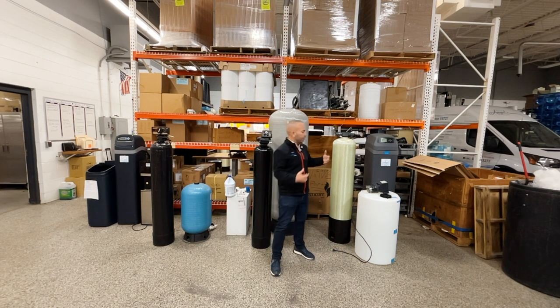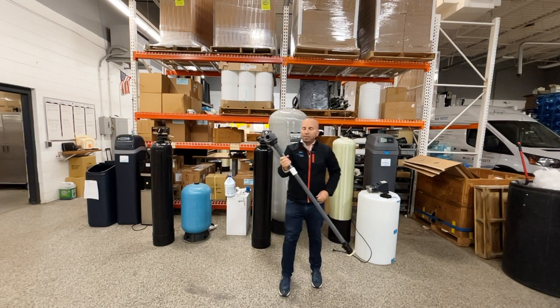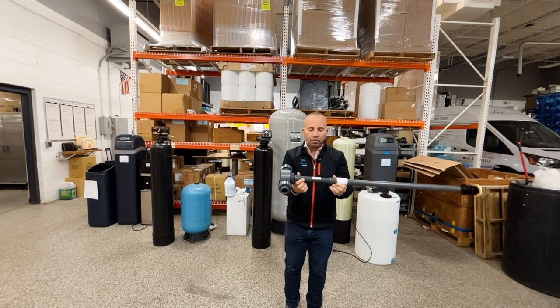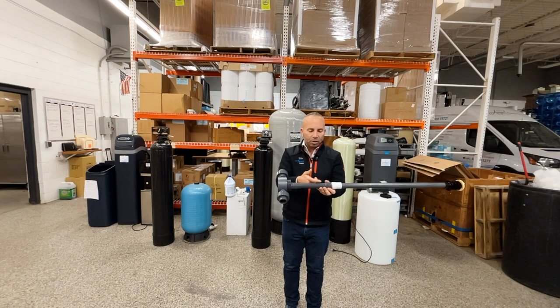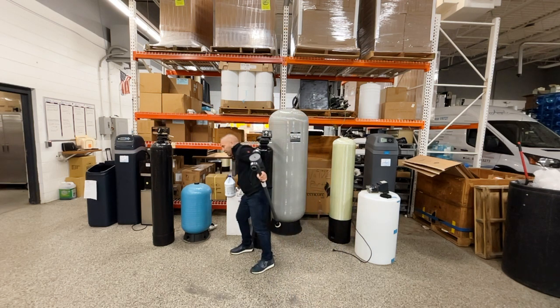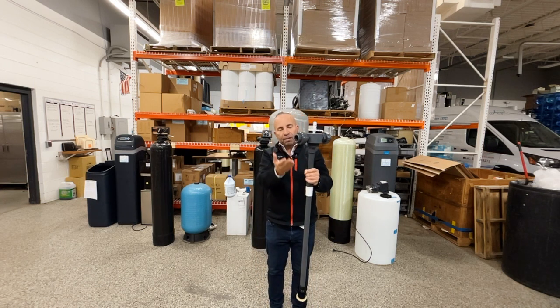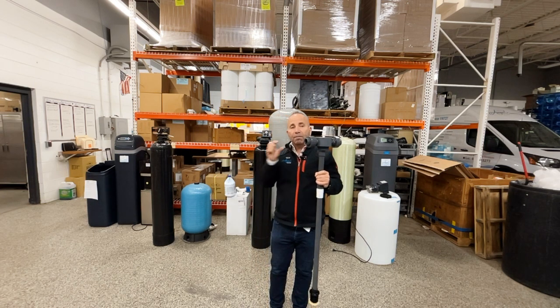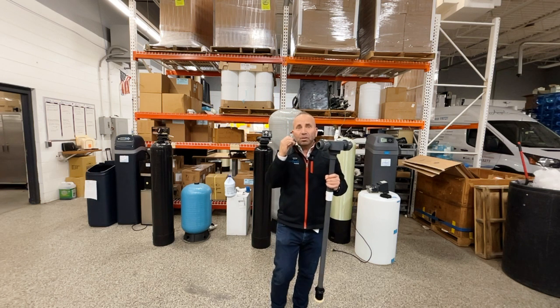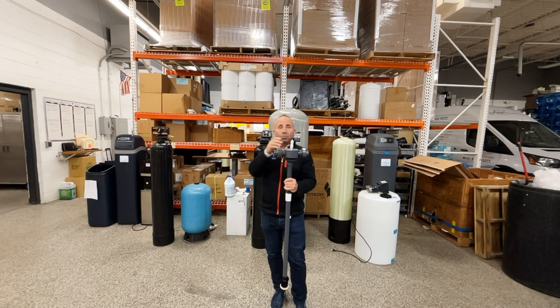So the Pure Clear chlorinator came to a different concept. This Pure Clear system, we talked with a major manufacturer that builds most of the static mixers in the world. This static mixer mixes the chlorine with the water. We also have the injection point on top of this head. This patented technology allows the chlorine to be injected and allows gravity to pull it down. So we no longer have those T's that would get clogged up. That's important to understand. We want to eliminate all those phone calls. Well, this thing did it.